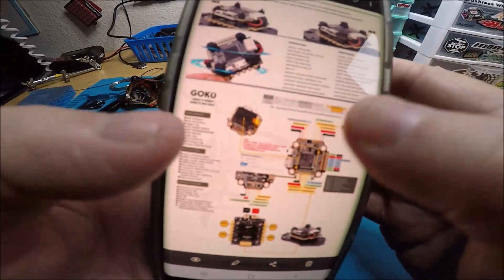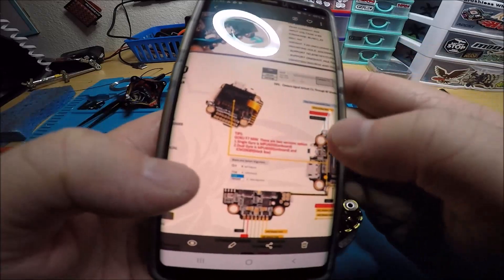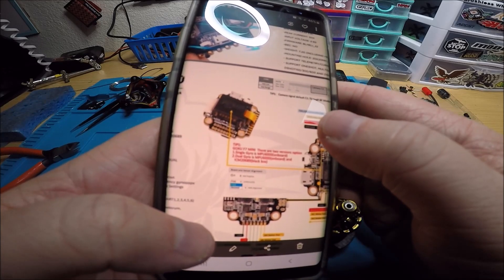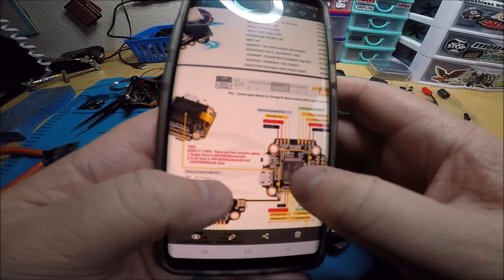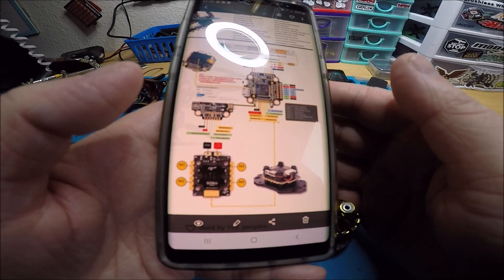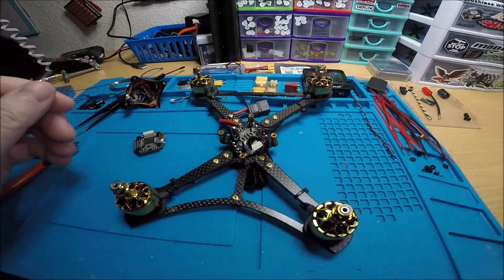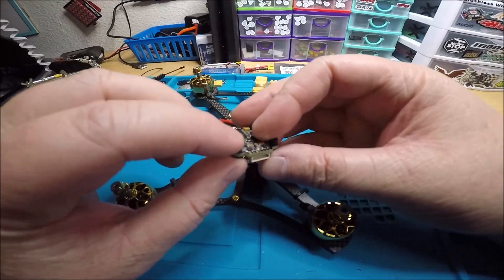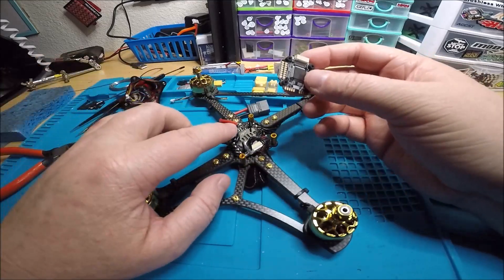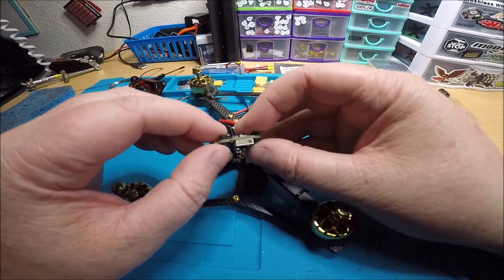Here's the other version with the sensitive gyro — it has a plastic case over the top. It's actually a dual gyro: it has the MPU-6000 and the ICM for black box. It'll do M3 for the mounting holes, and then it has rubber grommets to let you do M2. It comes with M2 screws, M3 screws — long steel ones — plus M3 nuts, M2 nuts, and the rubber pieces. So all the hardware you would need.